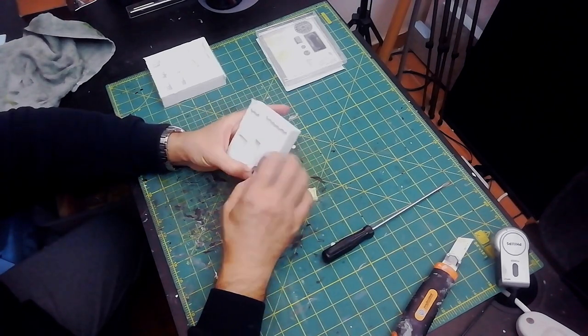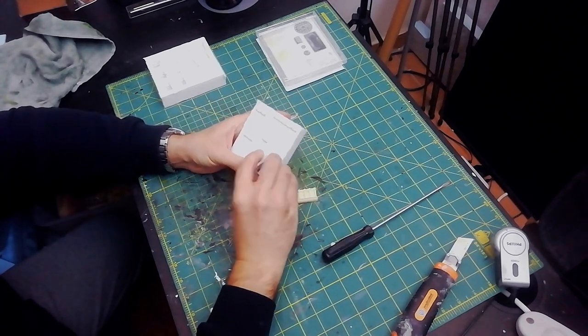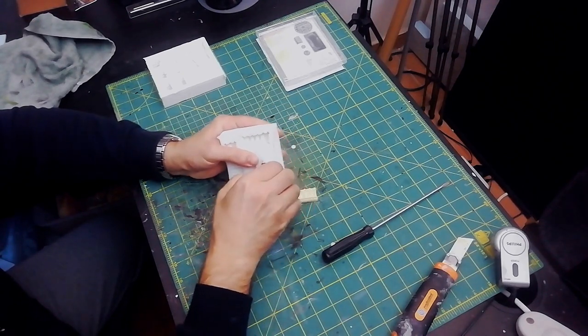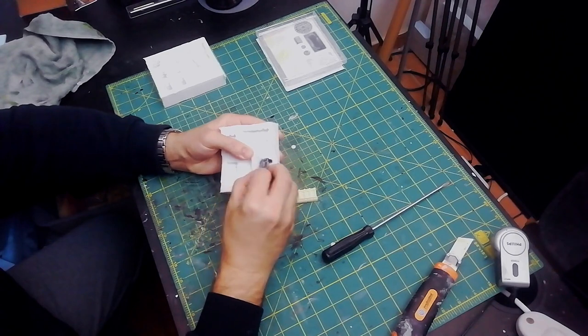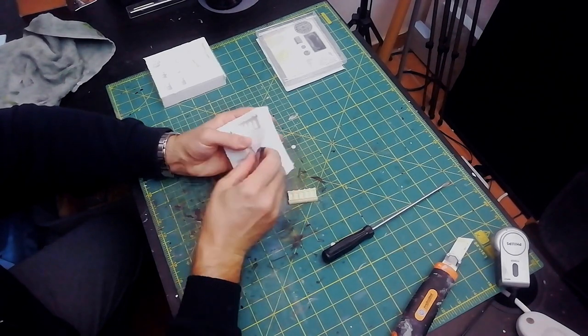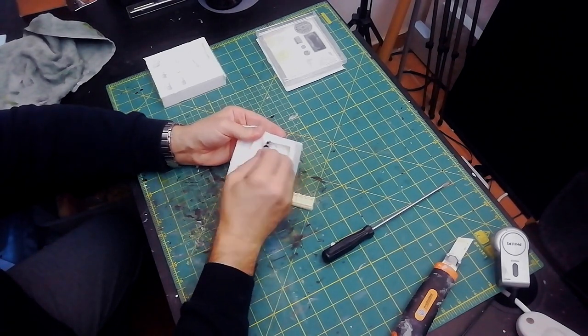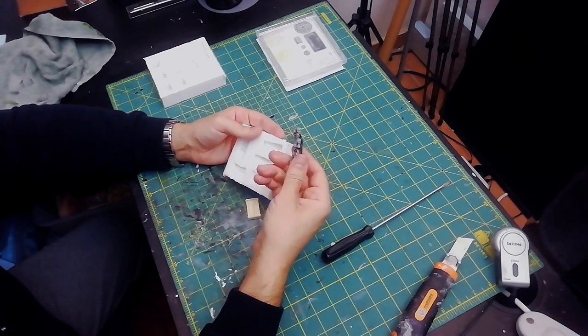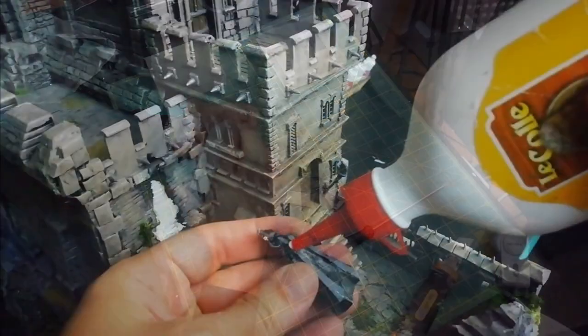Here you can see that I have to extract my statue with a movement that helps me remove the piece from inside the mold. Sometimes it is possible to make a clean cut on the upper part of the silicone to facilitate the extraction of the clone without compromising the seal of the mold. However, this is a technique that requires precision and experience, and we will not consider it here.